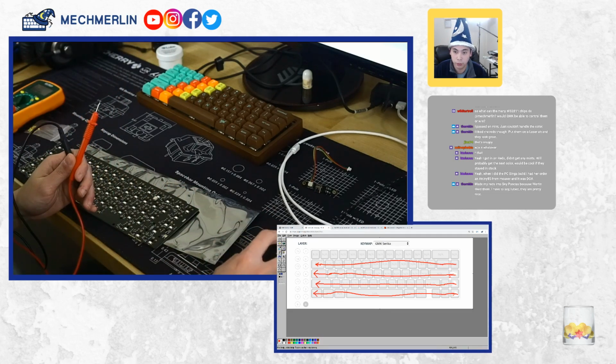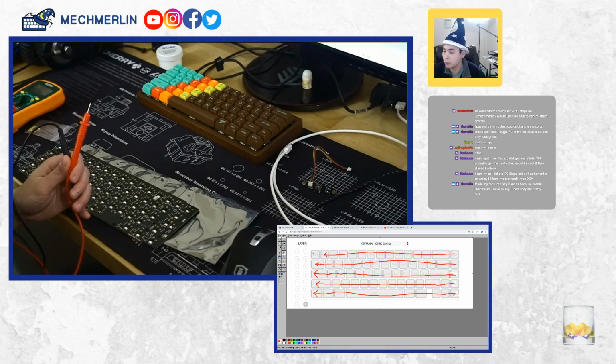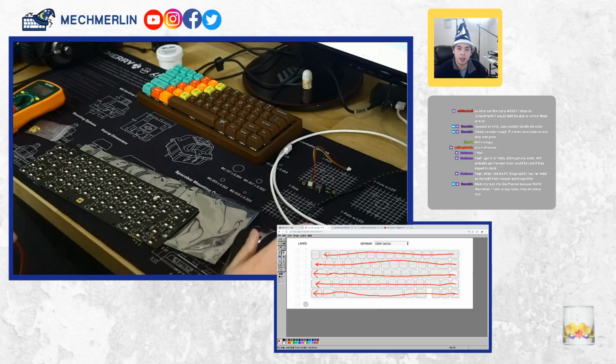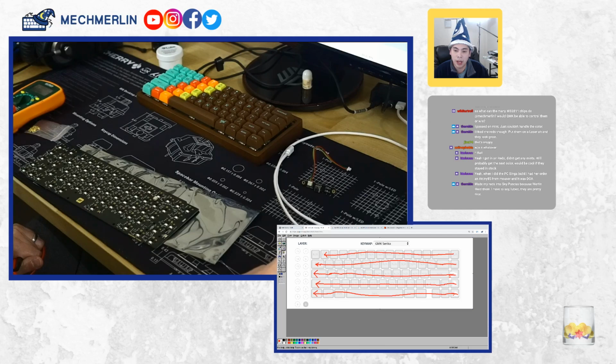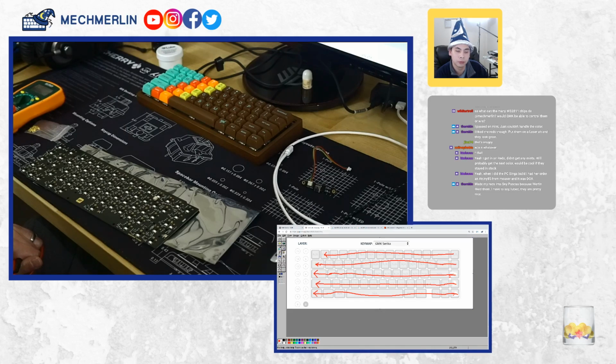Okay, it's all connected too, but I can't seem to trigger anything on the escape key there. Alright, so what's next here is, based on my understanding, this has to be an unbroken chain. So I need to know how they're connected on the right or on the left. All I know is that the output of this LED is going to the input of this one, and then its output is going here, and so forth and so on. So they're all going right to left, which would imply that they're not exactly connected the way I think it should be.